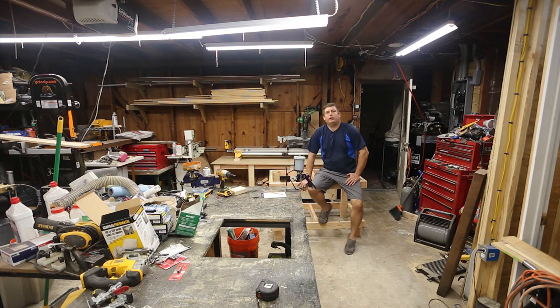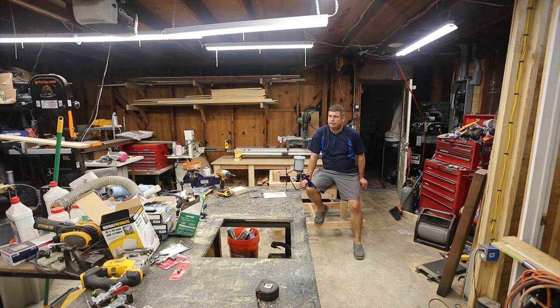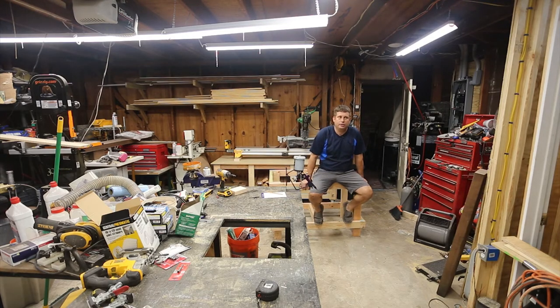I'm going to pause this video because I'm out of MDF large enough to fit underneath here — that's the next step in the assembly. I do have a piece of half-inch plywood that's perfect for the top. I need to get the bottom installed first, then paint the whole thing, and then affix the top and route the edges of it, at which point I can stain and polyurethane the top.